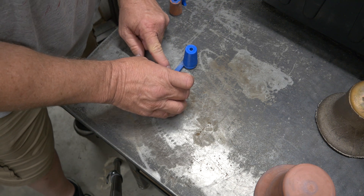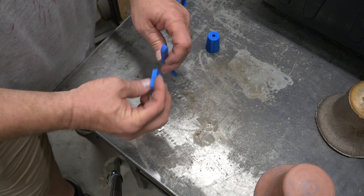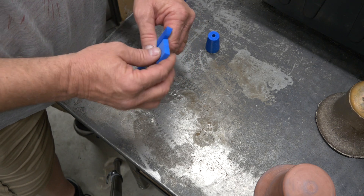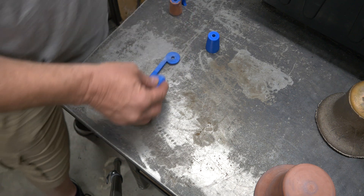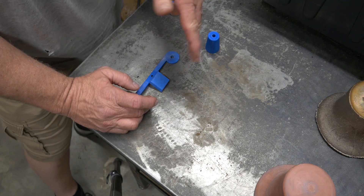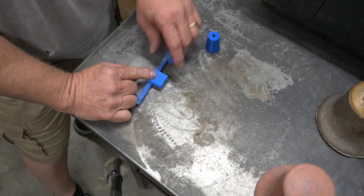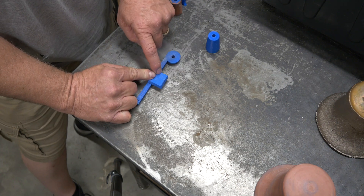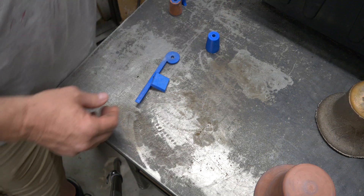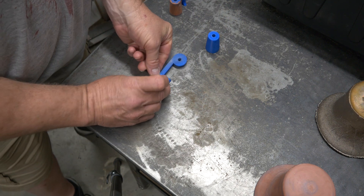I have a runner gate that I've built that will sit atop the runner like so. The gate is calculated to have three times the volume of the cross section of this runner. The reason I did that is I want to slow the velocity of that forward edge of metal - slow it down a little bit. This should slow it down by a third, since it's three times as large. We'll have the same amount of volume going through but it can run through at a slower rate, so that leading edge will be moving slower.